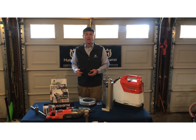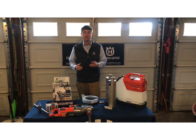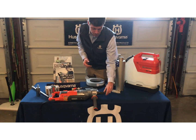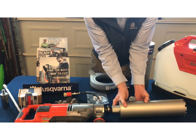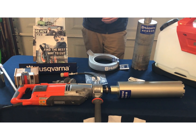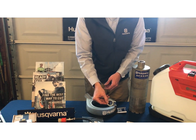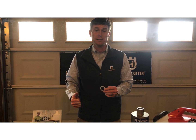If you've ever had to replace a core bit from a core drill, you know that can sometimes be a challenge. So I'd like to highlight our quick release washers. We make these in a metal reusable version. It goes between the core bit and the core drill itself, so when it comes time to take it off — or if you're on a job site changing core bits to go from a two to three to four inch — it's a much smoother transition. We also make this in a disposable version, which is great for a rental fleet. As the drill comes back, if the bit's on it, your tech can move on to the next job quicker rather than standing on two pipe wrenches trying to get them separated.